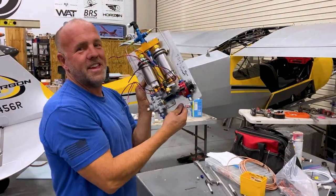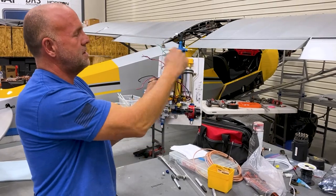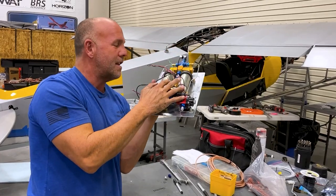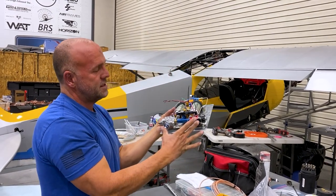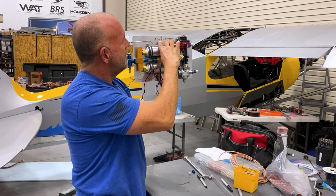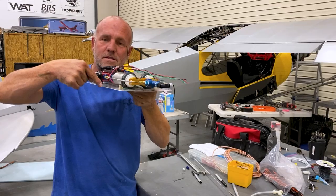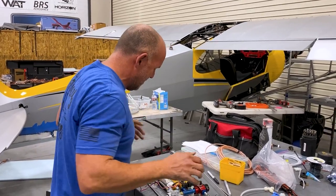We're ready to install the fuel pumps. Everything is done — fuel pressure for the NOS, fuel pressure for the carb. These are the two regulators, already set. Pressure gauge. These two little feedback loop lines keep the regulators absolutely spot-on. Dual fuel pumps, a bypass, a one-way check valve, and a fuel line that allows fuel to flow if both pumps fail — we have two pumps for redundancy. This goes to the fuel tank; these two go out to NOS and carburetor. Now that I've got this whole assembly ready to install — you can see my penmanship right here — this gives the weight and the center of mass moment. I actually literally balance this, then weigh it, then mark where it goes in the plane based on that center point front to back, so I can do my weight and balance as I go. This is going right by the fuel tank we put in the back of the plane.